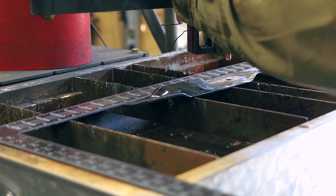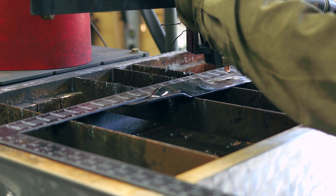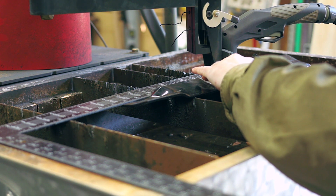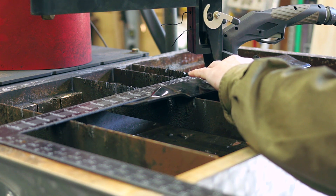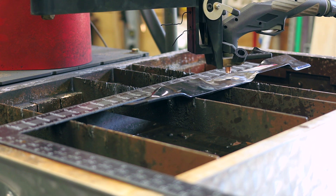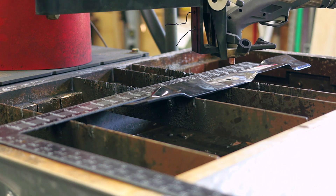It just sort of worked out that this one millimeter nozzle — the bevel that's on the outside — would fit down in and center itself perfectly in the existing hole that was there on the blade. That worked out really well. I could use the center as my zero point and have it cut exactly where I need it to be, all aligned.